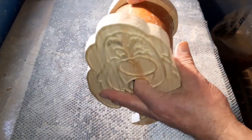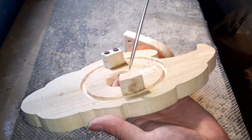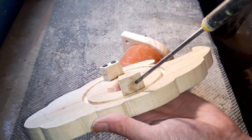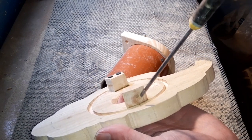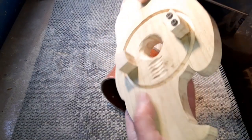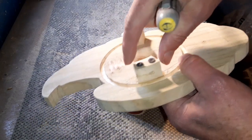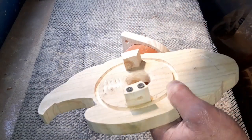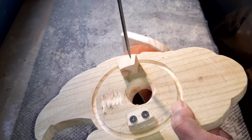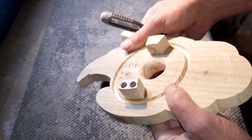And that'd be fine. What I did do with this, it caught me out, is because the blocks are so small, when I went in with the screw, it just split the wood. Caught me out this morning, a little bit too early for me. So I've re-glued it, this one down, and it's rough and ready, and literally just popped two screws in. Same again, that's not going to interfere with anything. To be honest, we should have probably drilled this, and we could have screwed them in there. But anyway, it is what it is.